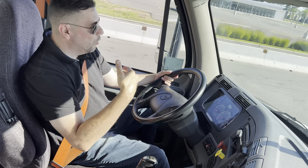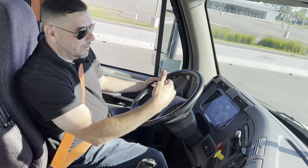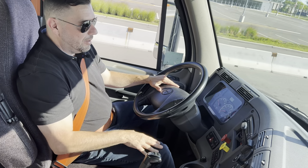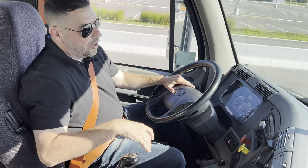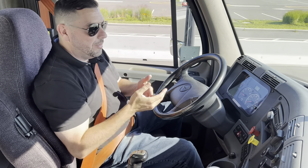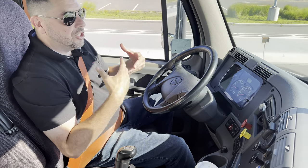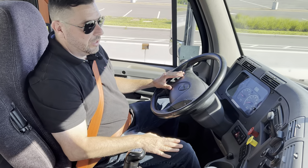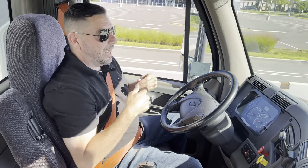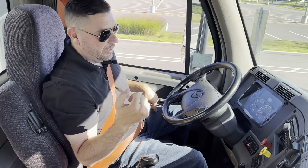If I give gas, the truck will accelerate. Once the RPMs start going up again, I let go of the gas, clutch neutral, clutch third, and the truck is rolling again. Understand that shifting has nothing to do with the gas, really. The gas is only in the beginning — once your RPMs are high enough, the actual shifting part is only your clutch and your hand.